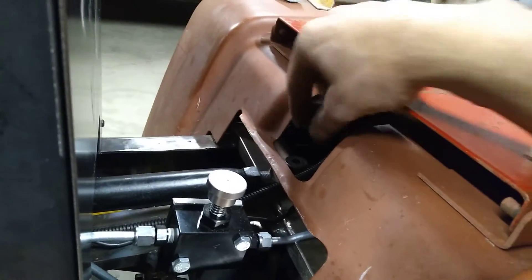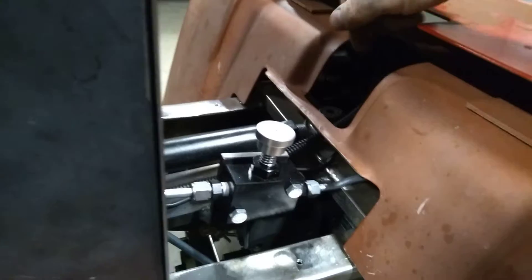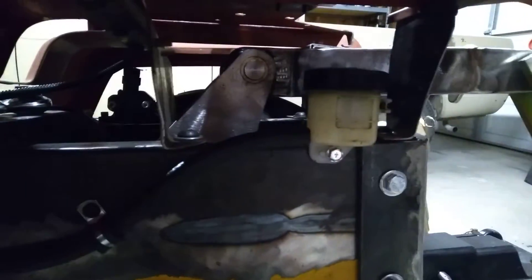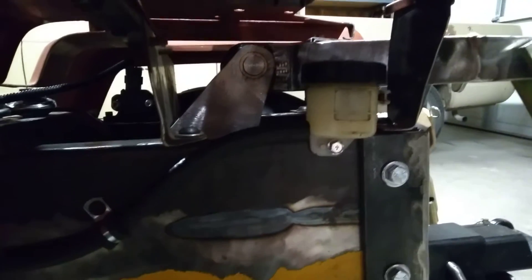This is the place I've come up with. Earlier ideas had it down here somewhere, but not only is that a little weird and awkward, I've got an actuator now for the three-point so that's not going to work. This just turned out to be a cool place for it. I made some brake lines — you can see that one just kind of comes around and goes down into my master cylinder. I also needed to mount my master cylinder reservoir, and that's where that ended up, which is kind of handy.